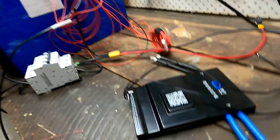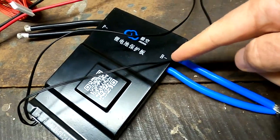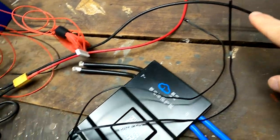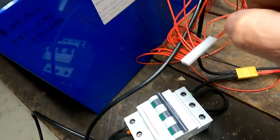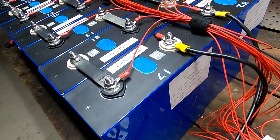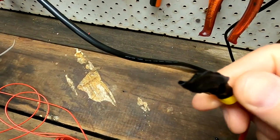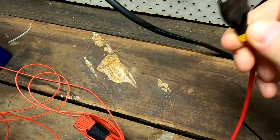I hope this is all correct — we will see now. I've used some crocodile clamps to get our B-minus here to the battery negative terminal, goes to the XT60 connector and up to the most negative terminal of our cell number one. We don't need the circuit breaker — we don't want to put any load on it. We just want to have a look at the BMS and the app, see what the balance current is, and how far we can configure it.